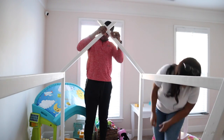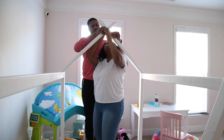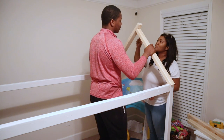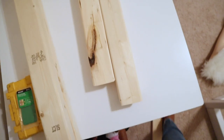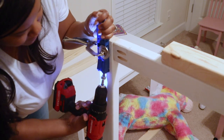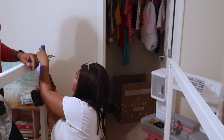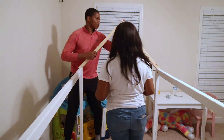We switched ours so it's completely different from the plans linked below — you can do either way and you'll come out with an amazing bed. We're keeping the bottom angles at 45 degrees, but instead of having angles at the top I'm making a cross cut so they fit flush together. One side is going to be longer than the other — those measurements will be down below and on the screen. I'm now creating more pocket holes on the inner portion of the wood to attach the top piece at all four corners.